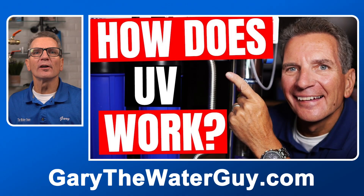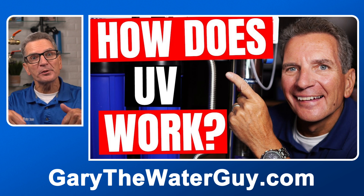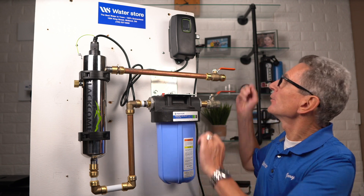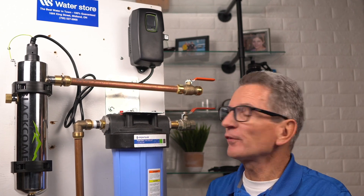If you're not 100% sure about how one of these UV systems work, I have a great YouTube video that explains the whole process — I'll put a link in the description below. Always be sure you disconnect the power before doing any work on your UV system, so you just unplug it. Then you're going to need to make sure you shut off the water.